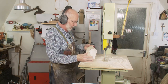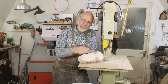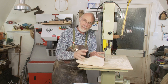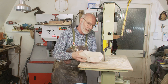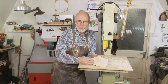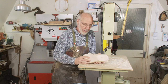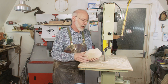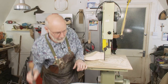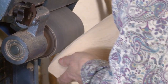What I have here is a kind of Picasso cubist last — all the corners are in. You see, just because I've got a really accurate outline and a very accurate profile, all the corners are still on and it doesn't in any way resemble the final last. So this is the bit where I'm going to do some very careful carving on the bandsaw to remove a lot of the surplus wood, and then I can go on to some much more modern sanding machines to remove the rest. When I was apprenticed we didn't have those sanding machines, so we would work on the bandsaw — which was a much bigger, more ancient machine than this — and then work with a rasp and things like that to fine-tune it. But now we have the luxury of coarser sanders which remove a lot of wood very fast.